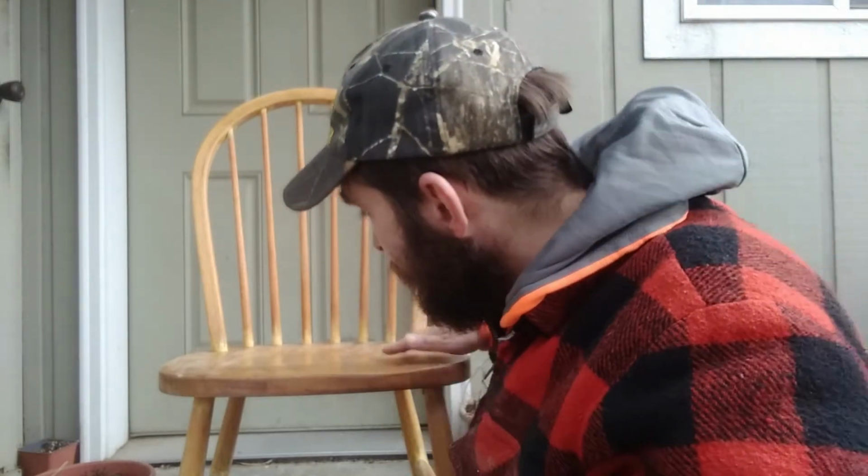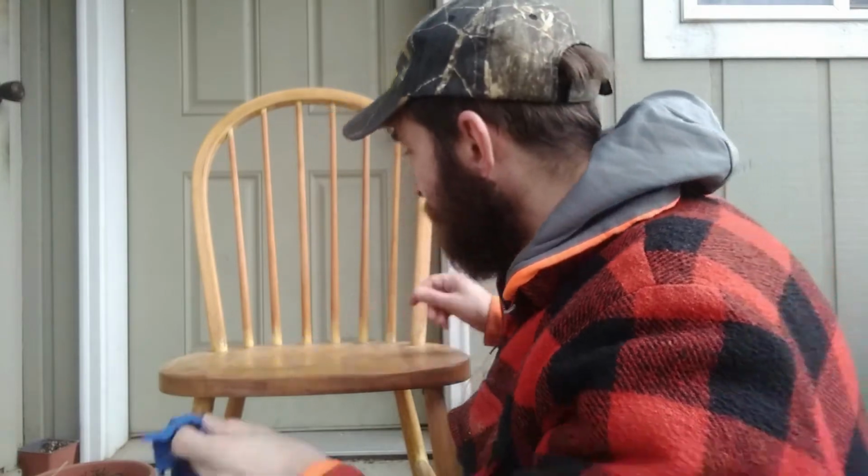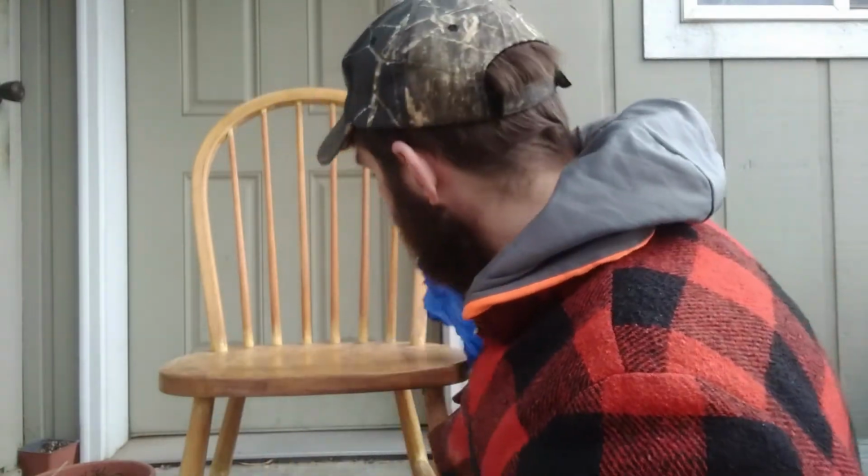So that leaves the imprint of your hand. You know, wash your hands. We're just breaking the surface. I'm not really going into the wood. I didn't even touch the wood, really. Just breaking the surface so I can get more oil into the wood. Give me more paste wax. So I'm gonna take my rag and clean it first.